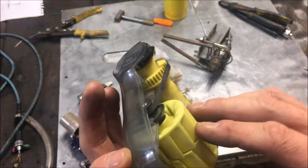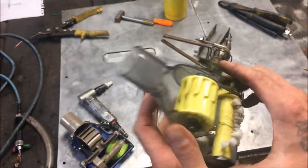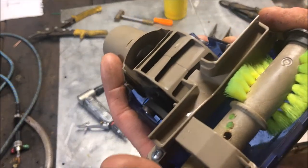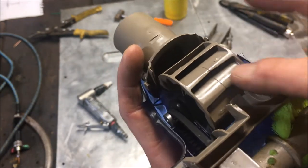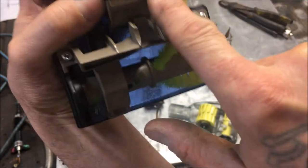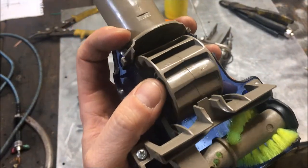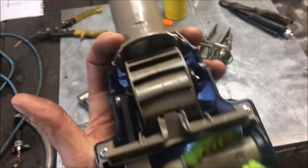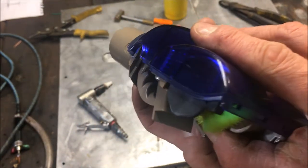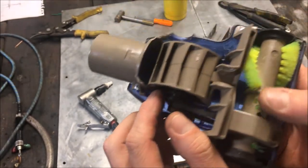This would be an easily repurposable high-efficiency turbine — these things are incredibly efficient designs. The shape of this inner cup shoots the air back out at almost 180 degrees, which is the most efficient configuration that you can get on a turbine. That is a very well-designed turbine. I don't know if you can see the shallow U-shape of that or not.